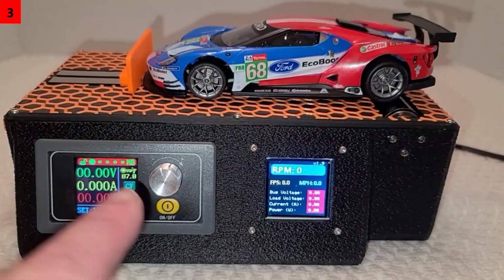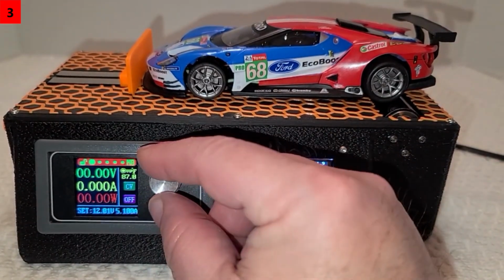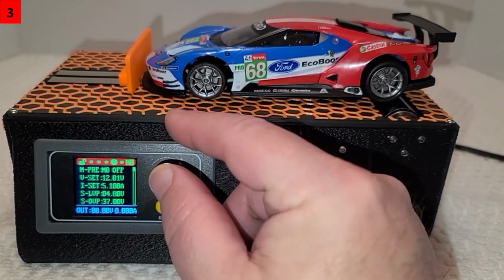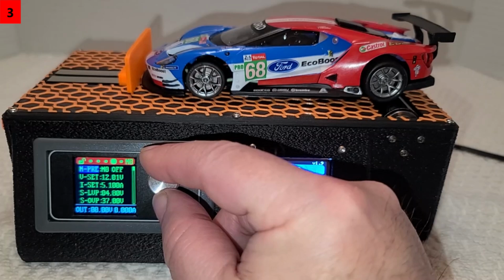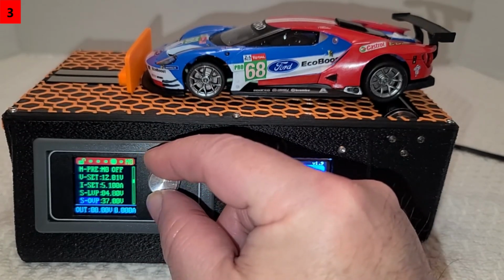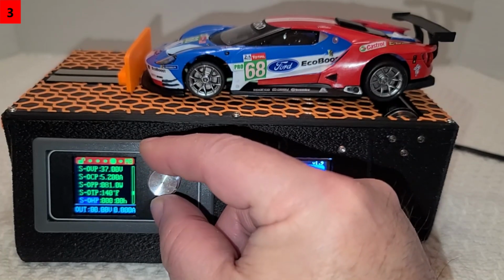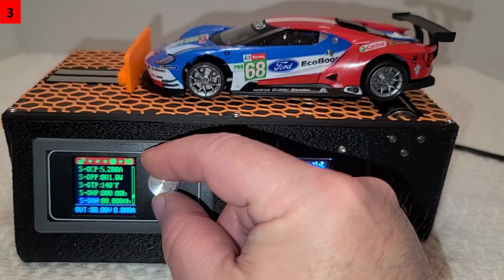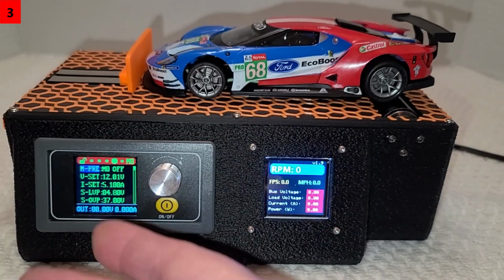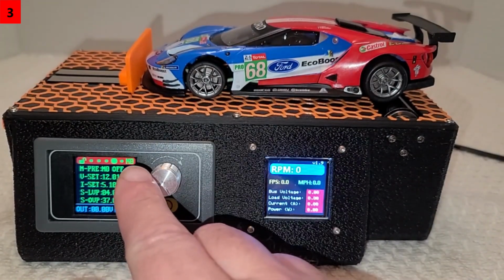The power module inside the tech bench is a full-feature power controller that contains a number of built-in protections that help make the tech bench safe to use. Among these protections are the ability to have the power module shut power down to the tech bench in the event of shorts, power, current, voltage, or temperature surges, and to limit runtime based on a predefined maximum runtime setting. All of these settings are configurable and can be saved in one of 10 memory locations for recall and use.